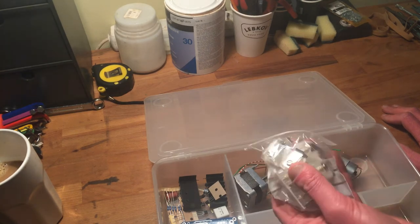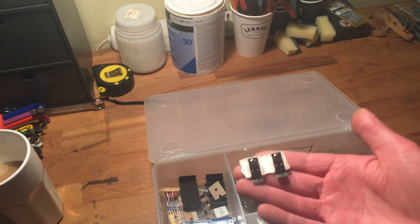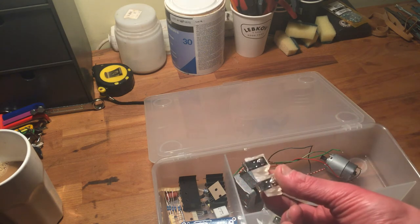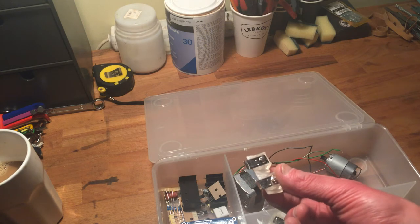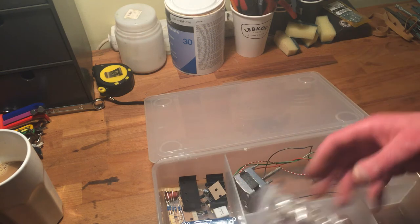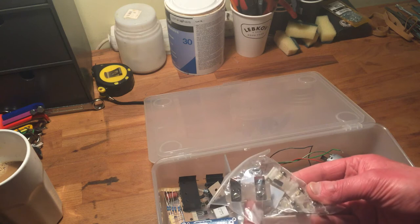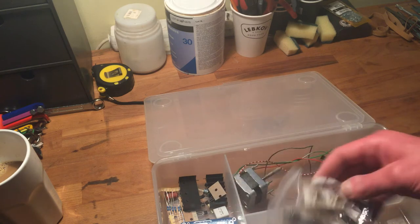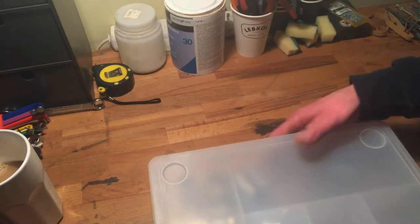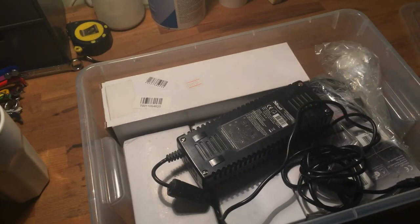These were nice if you were making panels with tape - there is always a problem connecting them to wire. I use these blocks, which I think are originally for window alarms. They use tape and you put it under this type of terminal and then you can connect it to a wire. So if you use tape on planar speakers you could use these terminals. You can find them at Conrad or Digikey - search 'alarm tape terminal'.